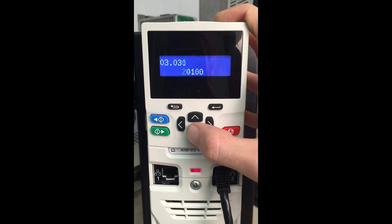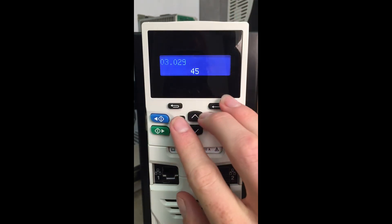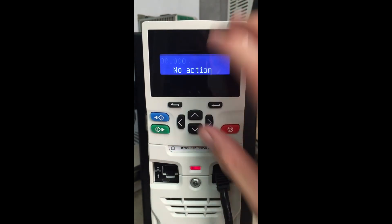We do have a 5 volt encoder — you would set that up in menu 3, parameter 36. If you have the ability to spin the motor, look at parameter 3.29 and rotate the motor one revolution. You should see the counts go from 0 to 65,536 and then roll over. So right now we can see we're right at that rollover point. If we rotate our motor shaft one revolution, you can see it went from 0 all the way up to 65,536 and rolled back over. That's an easy, quick way to determine that you've set up your encoder counts correctly.